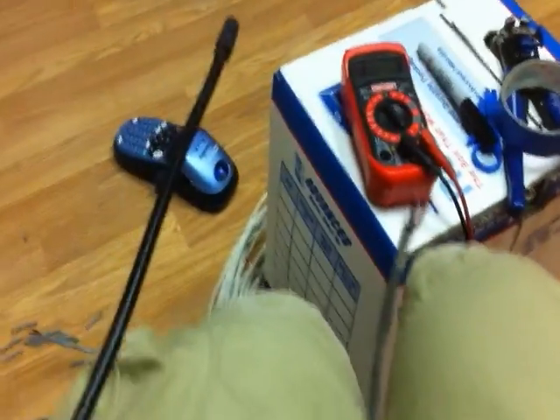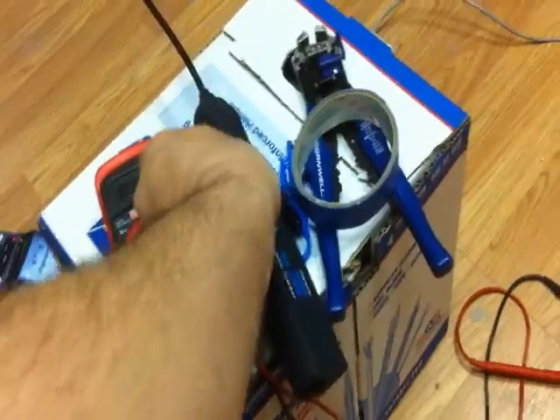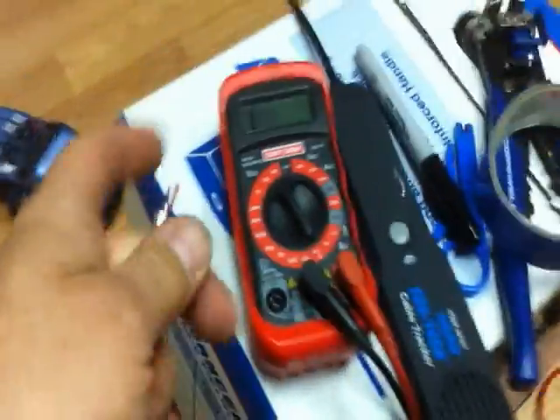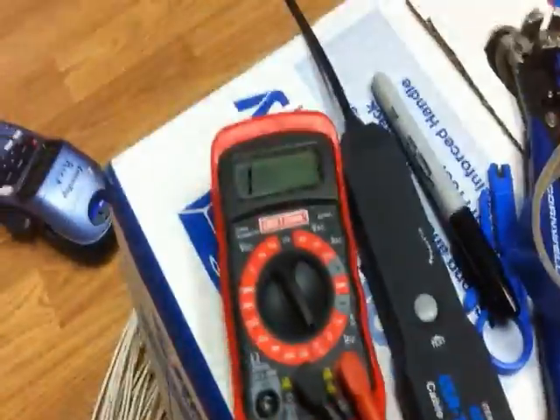Take the cable tracker, hold the button — hear how you can barely hear that? That's about all you're going to get with a shielded wire. That barely-audible sound gets you in the neighborhood of the bundle. I've got 22 lines here, so then I take my multimeter.